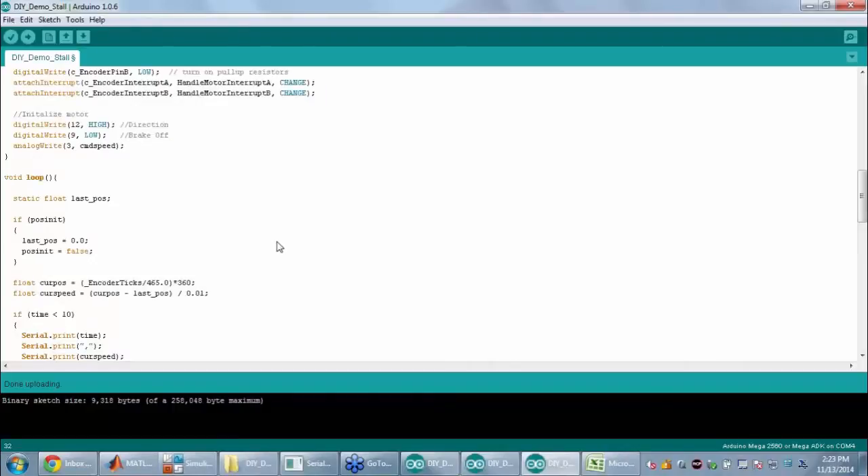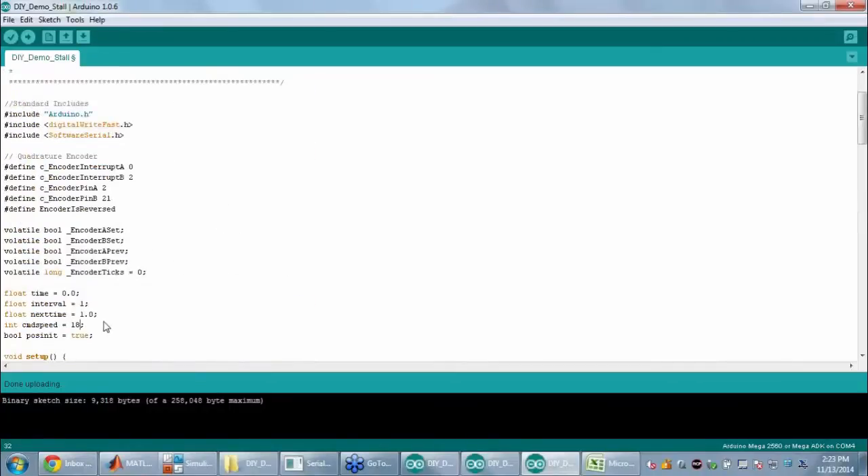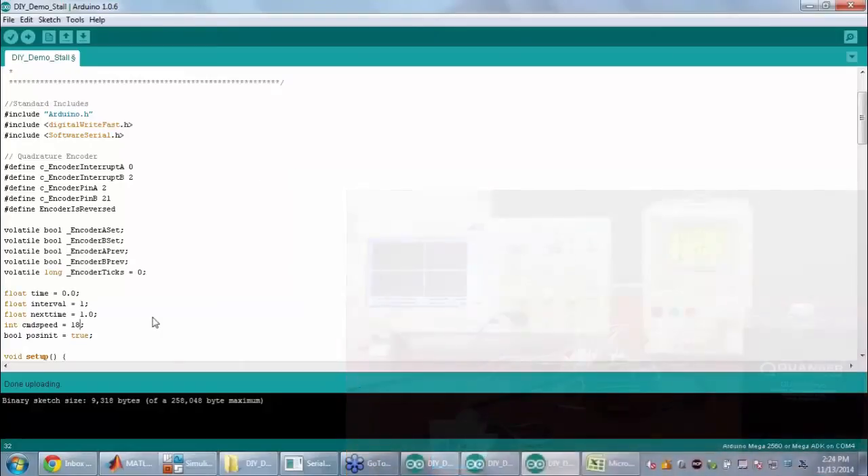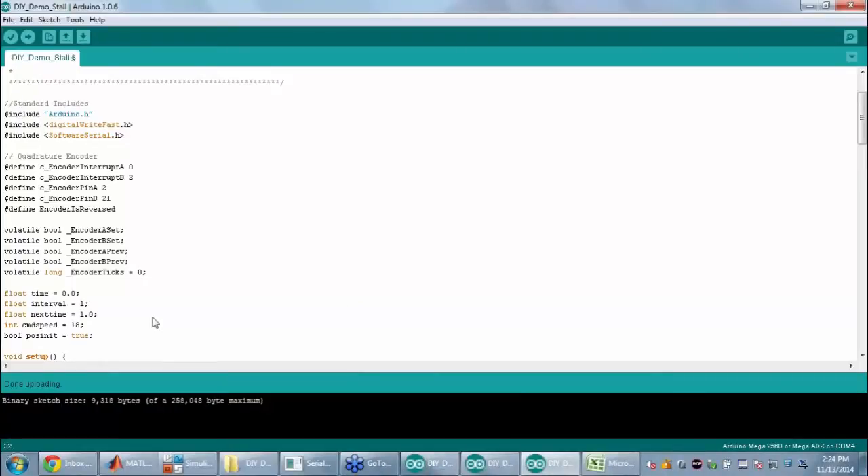This gives you a flavor of the background knowledge you need to build a DIY solution using a simple Arduino and DC motor. I'm going to give it a command of around 18 — roughly equivalent to 450 to 500 millivolts — just enough to get the motor moving. You can see it's moving very slowly and I can still stop it easily. That value you have to overcome before getting movement out of the output shaft is roughly around 400 to 500 millivolts depending on inertia — let's call it 400 millivolts.